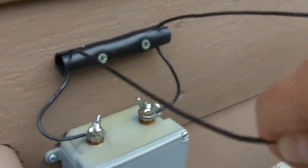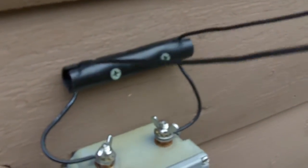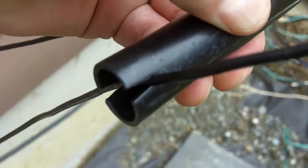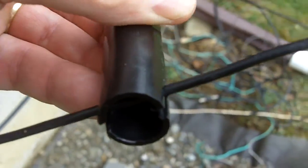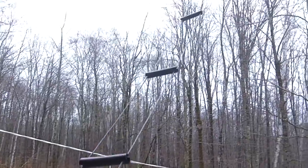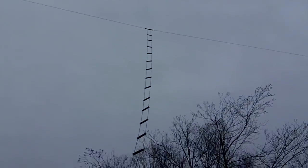The way this works, I can pull on these wires all I want — based on wind and so forth — and they will not come out. That's just the original punched and drilled spreader. Here's a quick look — I'm going to zoom in again. It's a little difficult to see, but that's how it works and they stay in there quite tightly. So there you have it: the easiest way to bring a true ladder line fed right into your shack.